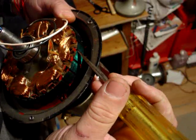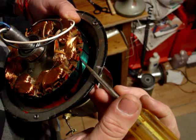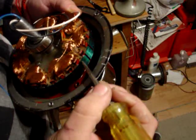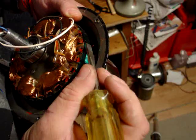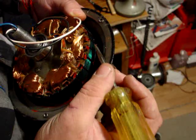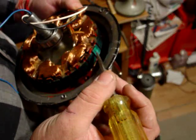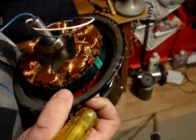This is half an inch and this is half an inch, meaning a whole inch, with one eighth inch in between. Then you've got another inch and one eighth here. From here to here is also one half inch, so half-inch square magnets will work — two of them side by side going north and two going south. I hope that clears up that part of it.